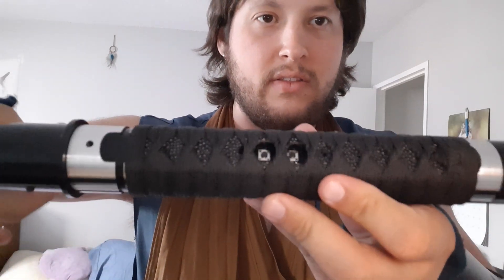That really should be it. I hope you enjoyed the demonstration video. If you want anything changed on the settings, fonts, order, or colors, let me know ahead of time before I ship this out and I'll see what I can do. Before I sign off — to put the chassis back inside, slide it in through the front. Push on the top, not on the pins. Don't start poking around the pins and don't poke the speaker — common sense things, but we live in a dumb world. Push the top with your finger as far as it'll go and slide it until the switches line up correctly. Be careful as it will slide if you teeter it.